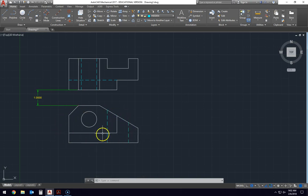On this drawing, the hidden lines — these vertical lines here — if this is from the side, then we rotate it up and we would see this little chunk taken out right here. These two lines line up exactly with these lines right up here, so these lines transfer straight down and you see these lines here. This hidden line going across the side is this little ledge. This part right here has been cut out. These final hidden lines right here are on either side of the circle — this circle is a hole punched through the whole drawing.